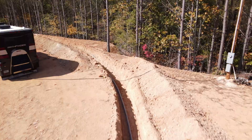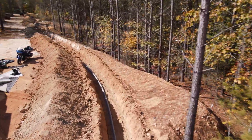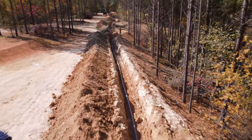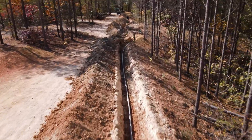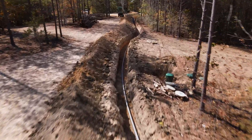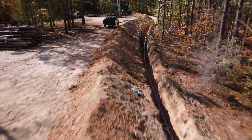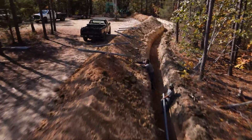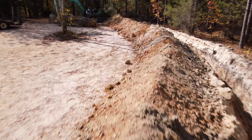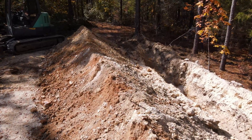We had to cut the corner of where the building is going to go — you want to try to avoid that, but we couldn't because of the way the building's going to go all the way across the front of the property. You'll see a guy working on the first transformer location, and then the conduit continues from that first transformer location to a second transformer location. The conduit will then terminate back here in the woods so I can build on to that in future phases.